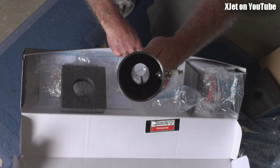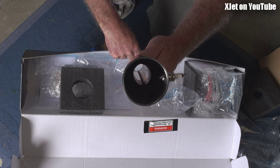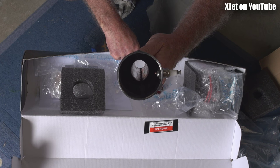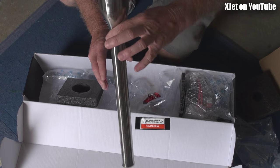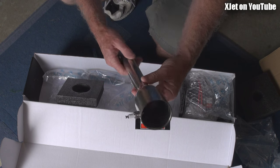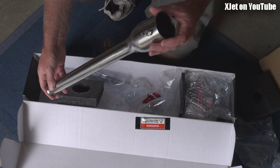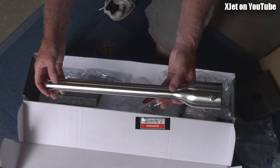It's important that these pulse jets are round in shape, because when you turn a round shape into an oval you actually end up losing a lot of cross-sectional area. An oval or ellipse has much lower cross-sectional area than a true circle. So the tuning goes all to hell in a handbasket. This is way worse than the first one I bought.